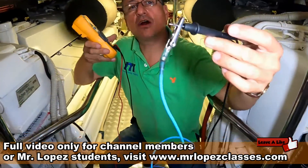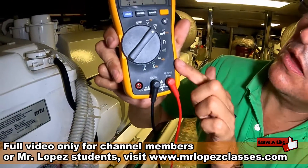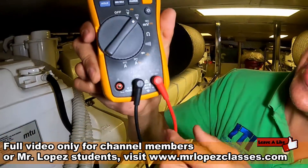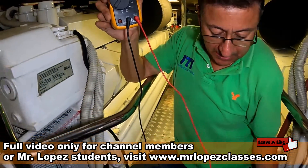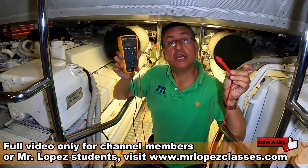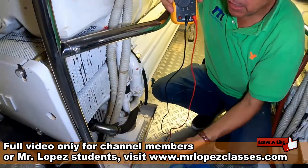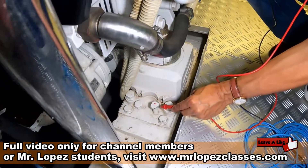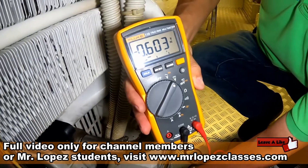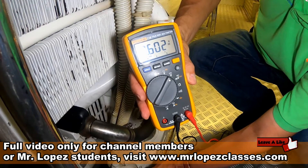The wire of the electrode is connected to the negative terminal on the multimeter selected on DC. And the positive terminal will be touching the element that we are checking the reference for. In this particular case, we are going to touch one bolt in the motor mount. I remove the paint, and we are going to check: minus 0.600, minus 0.602.